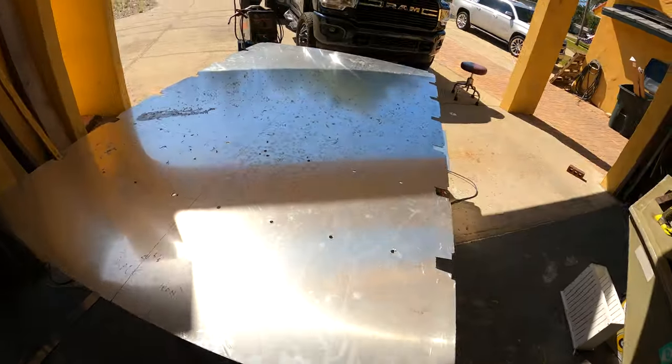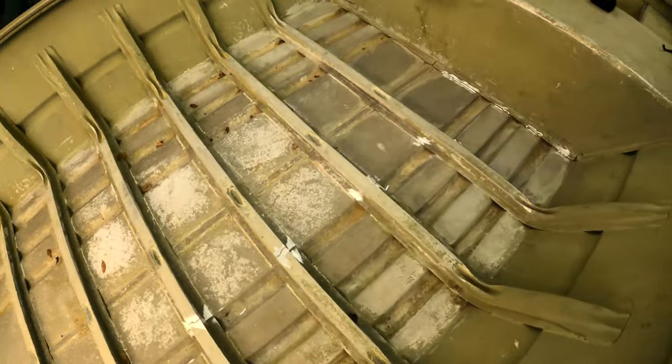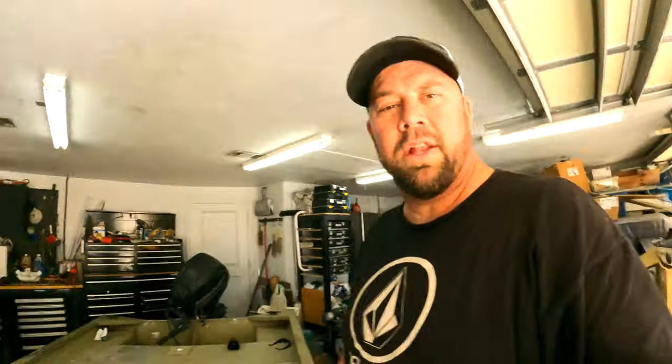The metal's all prepped, that's done. Now before I put the metal in I'm going to fix these cracks that we had in the bottom of the boat. I'm just cleaning them up with a grinder right now, making sure everything's clean. When you're welding aluminum you have to have clean metal - it's going to spit and sputter if you don't. It's very important that you have clean aluminum, so I'm just grinding and trying to make it clean so I have a good connection there.